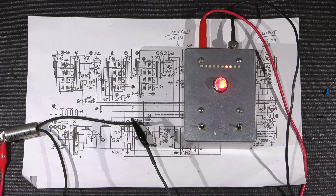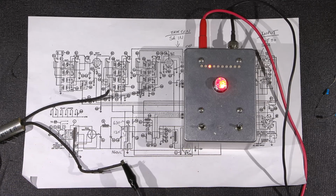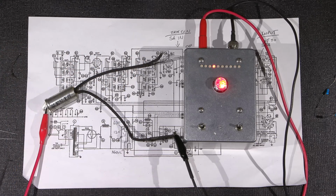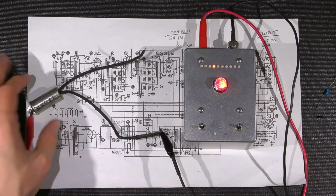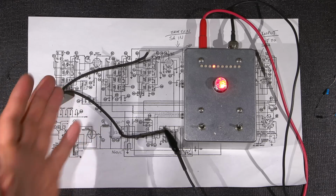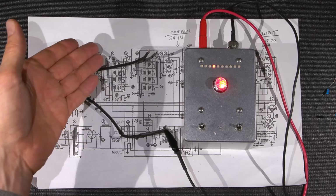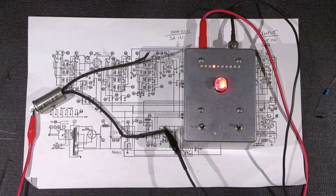So how do you like that? That was caught just in time. This other side here seems to be pretty constant. This one here wasn't doing the same thing. This one here is just showing a fixed resistance. So that other side would have been the extremely dangerous side. So crisis averted there. Just think, somebody had worked on this thing and left this in there, and that was on the verge of happening. The chassis of this radio receiver was on the verge of becoming live. And who knows, if these had actually shorted, it would have taken that fuse out, right? That little fuse would have gone away. And that's hard on things. It's hard on the power switch, and it's hard on all sorts of things. So definite crisis averted right there.